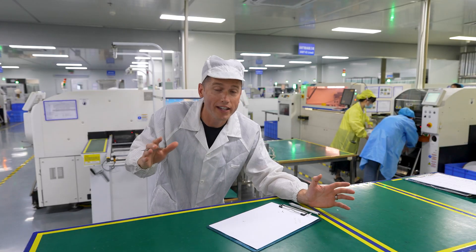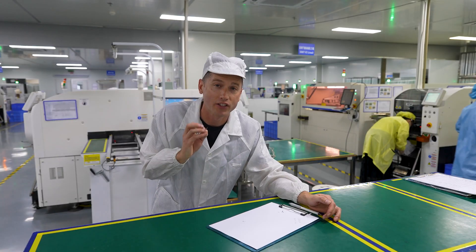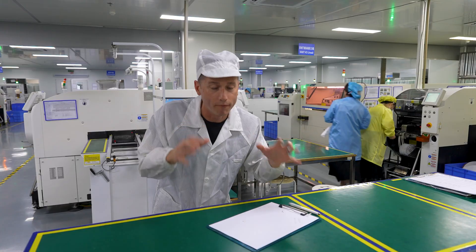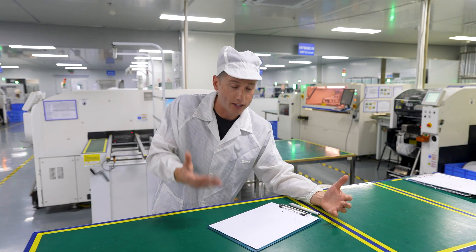On a 10-foot by 20-foot screen, there are over 5,312,160 diodes — that's a lot of little parts to nail. That's why so much emphasis is put into that diode and the manufacturing process, because that's essentially over 5 million points of failure that could potentially happen. It is really important to consider quality when it comes to your screen because it's a big investment, and every little diode that has a joint that disconnects will cause a dead pixel.